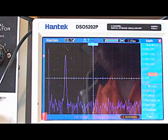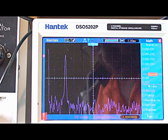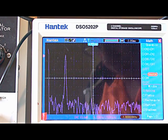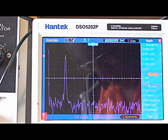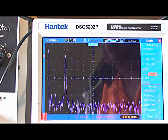That is actually the performance specification of the AD9833 — around that sort of figure. Total harmonic noise and distortion around minus 60, and noise around the carrier minus 66. Those chips will go up to 12.5 MHz by the way, but I'm using them simply as audio test generators — two tone test generators in fact.